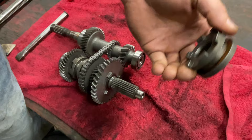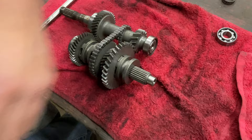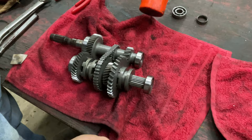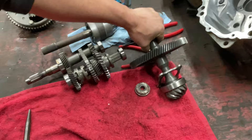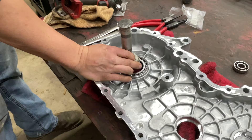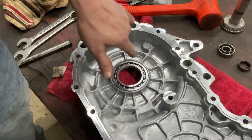Now it's time to put on — I call these dog ears — put this on. It's going to go there, and we've got our old bearing. We're going to put a new bearing on — I'm probably just going to use a hammer and peck this one on. So we've got all our bearings and stuff changed on this. We've got our bearing on our output shaft changed, on our bull gear changed. We've got our bearing in our case. The only bearing we've got left to change is we've got to put our bearing in our new case here. We've got this bearing in — now it's time to put everything together and put our two halves together.